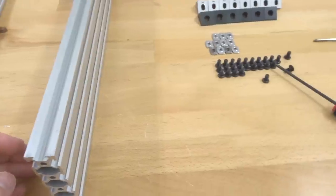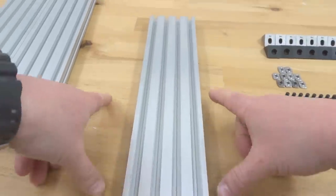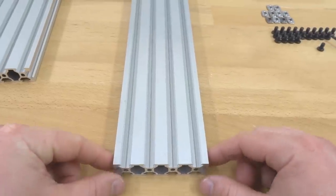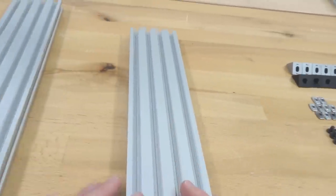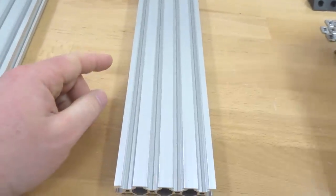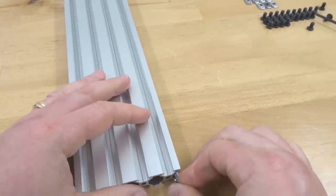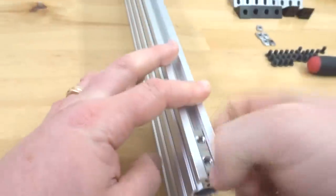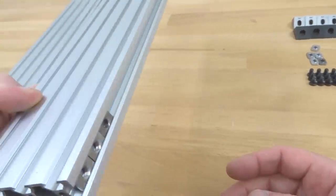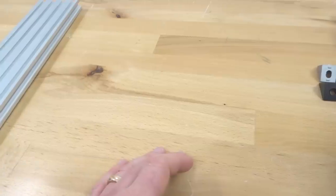Flip it over and insert two more. So this is going to be our centerpiece — two on each side for each end of our 20 by 80. Now, instead of having two on each side, we're going to have three on one side as part of the configuration for building up our C-beam for our Y-axis. Put three of our T-nuts on the right side of this 20 by 80 rail and two onto the opposite side. This will be for our right side, since we have three on our right side here in the slot.